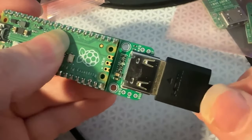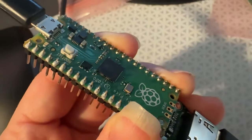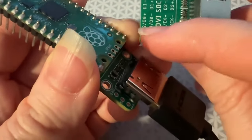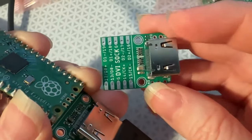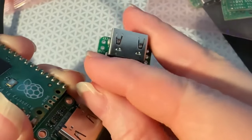You can use it to display up to 640 by 480 with our code — full color, which is 320 by 240 pixel-doubled — but still pretty nice, great for little retro projects. You get a full frame buffer, and it's just bit-banging over PIO: three lanes of data plus clock, some resistors inline, a DVI connector. You can use an HDMI monitor, some capacitors, and pinouts for hot plug detect, CEC, and five-volt ground.